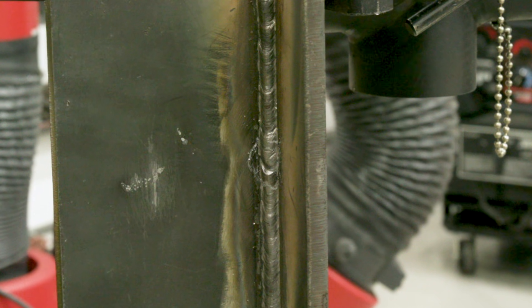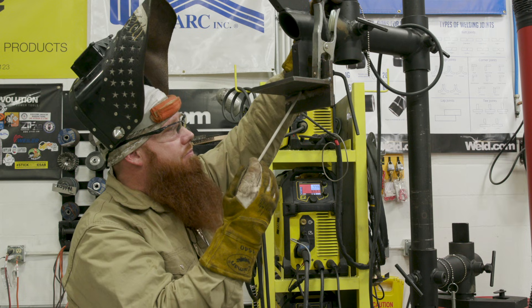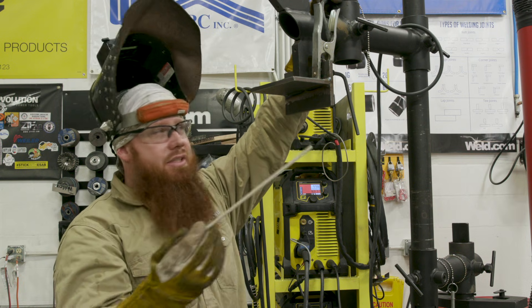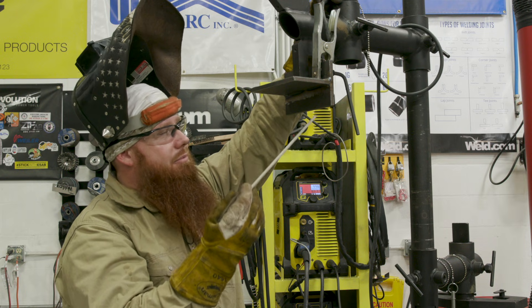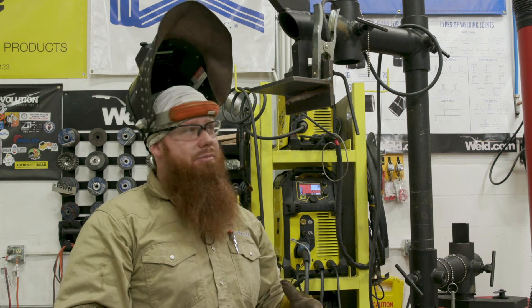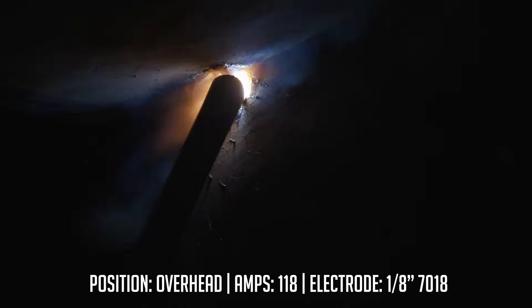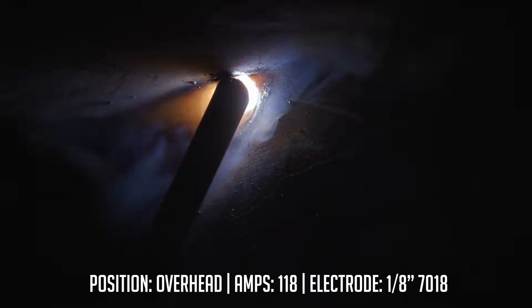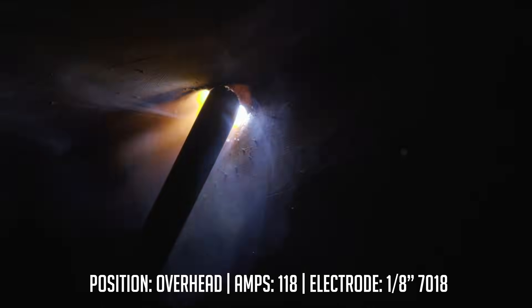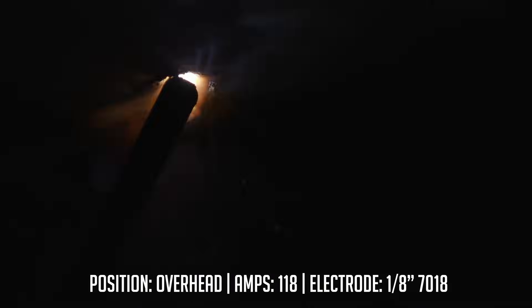Let's go ahead and hit the overhead. Now we're in the overhead position — 4F, overhead fillet. I'm gonna strike in here, weld about a third to half, terminate, and whip right out of that puddle. For the restart I'll use the same rod — stopping prematurely to show you how to restart with an electrode that's already been used. This is especially important if you're buying your own electrodes. On a lot of job sites you see piles of still-good rods in the waste bucket. If you have to pay for your own welding rods, that adds up real quick. Switching to overhead, I bumped my amps back up to 118 — I like to weld a little hotter in overhead than in vertical, and just a little colder than I run in flat.